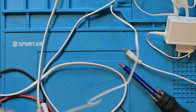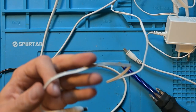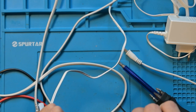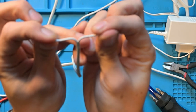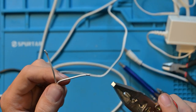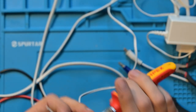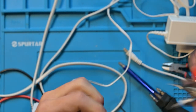I'm going to cut a bit farther down so that I can still use this plug if I want to. So we're going to go 10 centimeters and cut here. That's going to leave us with two wires. I'm just going to make a small cut in the middle and then they should pull apart like so. Now what I'm going to do next is cut off the parts that I just cut into to open them up, because there's a risk that I've damaged the wires somehow. So now I have two wires — I'm just going to strip them for about a centimeter.